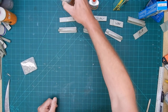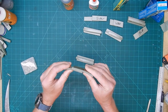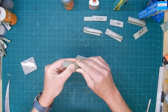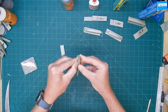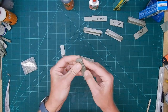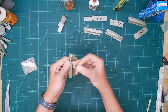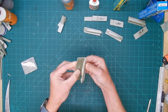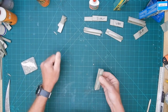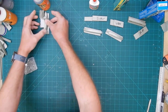Foaming standard Gorilla Glue. You get the foaming on the outside but that sands off quite nicely. That's on there — if I tried really hard, it's peeled off and taken a small layer with it. The cap strip stayed on well and it's actually taking some of the surface off. The downside of the Gorilla Glue for me is the fact that it takes 24 hours to go off. I'm putting that as a possible, not failed.